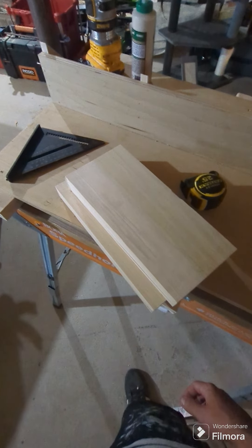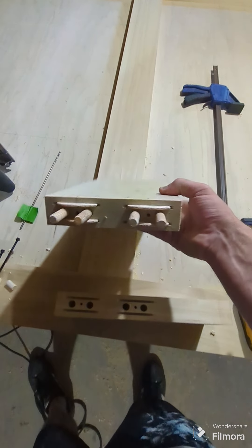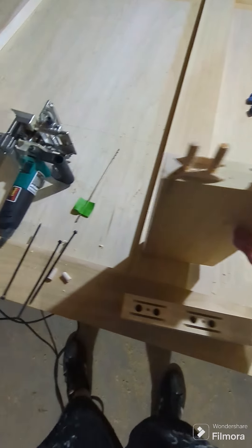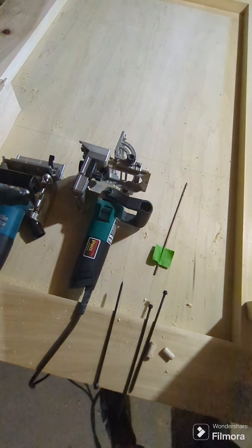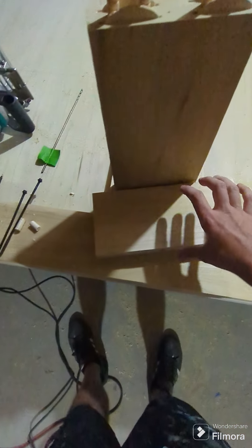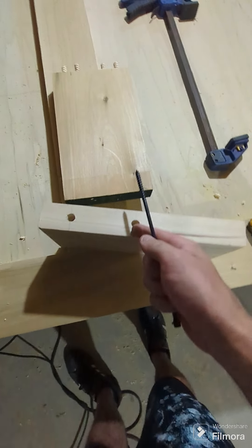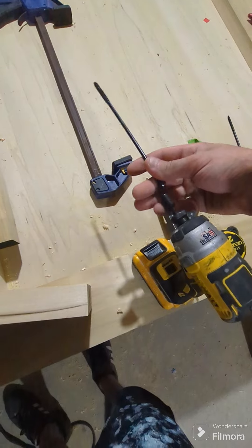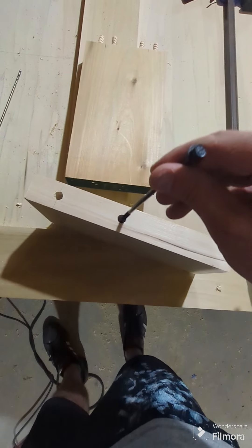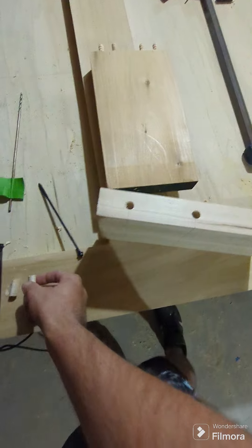This looks a little crazy but here's what I'm planning for the joints: I've got the Grizzly dual spinner domino joiner. I know it's got mixed reviews but I was able to dial it in pretty well. I'll chase that with a half inch forstner bit, which allows your 5/16 lag screw bit to fit in there so you can then plug it.